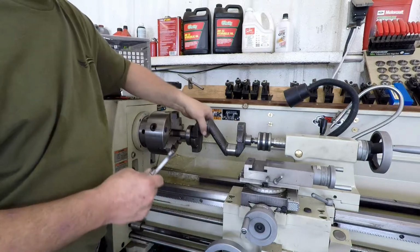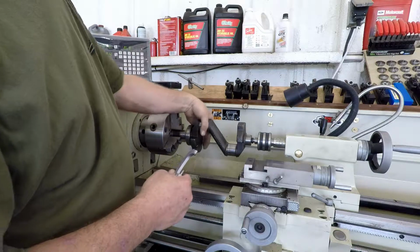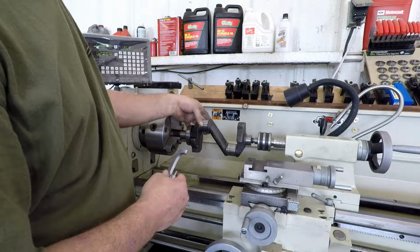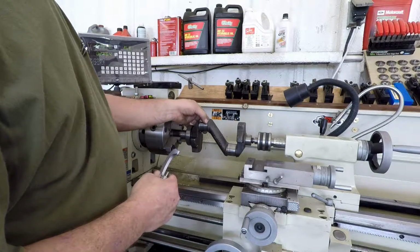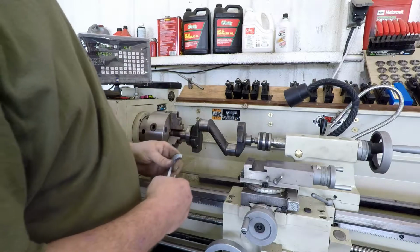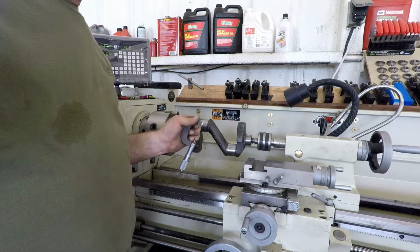And I've kind of polished on that and polished on that a little, just to remove that old aluminum material that's stuck to it. This is usually a little bit harder than the rod, so if you don't run it ridiculous long time with problems, you can usually get by with reusing the crankshaft. So let's go look the specs up and we'll get back.